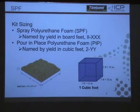Those tanks should be upright, on a flat surface, because it's got a dip tube. Not on an angle. If they're laying down, at the beginning they'll spray, but once you get through part of the product, you'll start getting air purges into it, and it won't be good. And when you're done, just open them up all the way, and then spray out or release. Then you pitch them. So the tanks are empty.